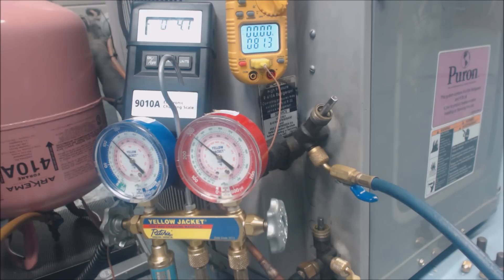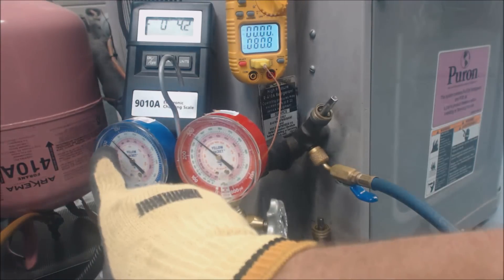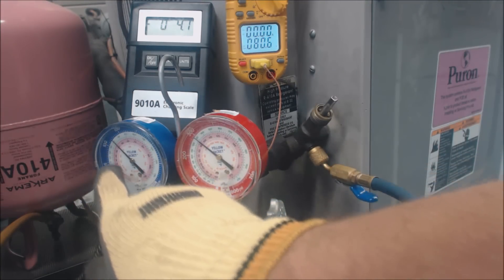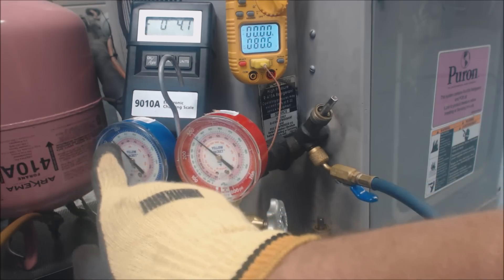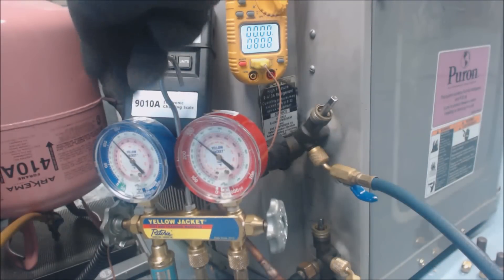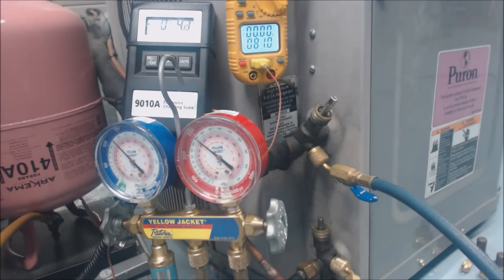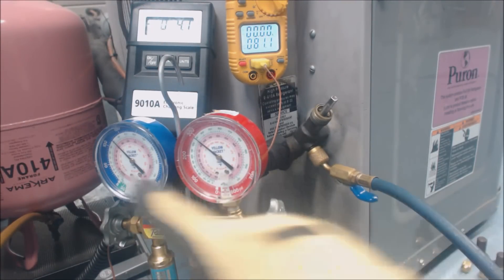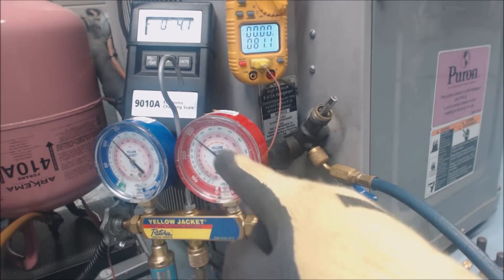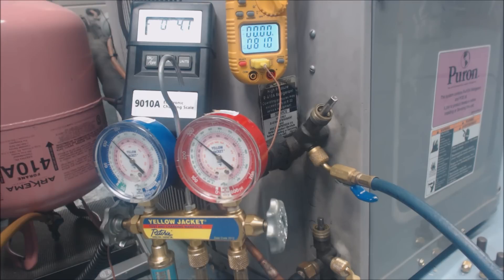During this process I already made sure that our suction line temp was above freezing — you always want that suction line temp absolutely above freezing. On the low side gauge, following the pressure into the pink ring for 410A refrigerant: it reads 123 psig, which corresponds to 41°F in the middle of the evaporator coil — that's the indoor coil. On the high side, we're at 94.3°F saturated with a pressure of about 295 psig — that's the liquid line, the outdoor condenser coil side.